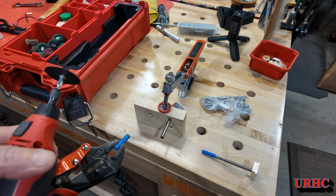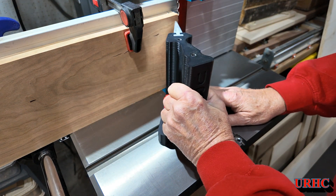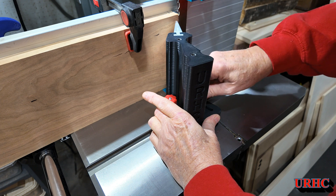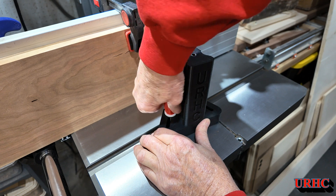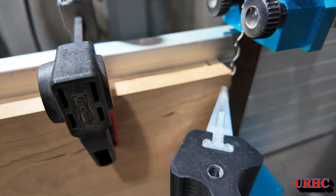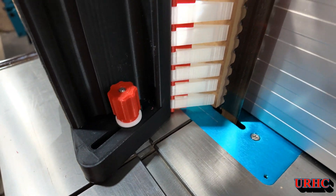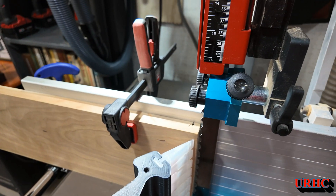I got them shortened down, just kind of ground the end a little bit to make the thread easier to start, and everything's all done — time to try it out. I've got a piece of cherry I'm going to re-saw for laser projects. It goes in place, tightens down nice, doesn't move with that anti-slip piece on the bottom. I can only put a little bit of pressure because it's a tremendous amount of force right now, so I'm going to have to work on thinning down the fingers a little bit. But it definitely fits nice and does put pressure on the board.